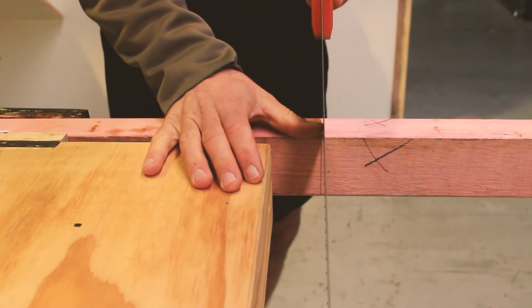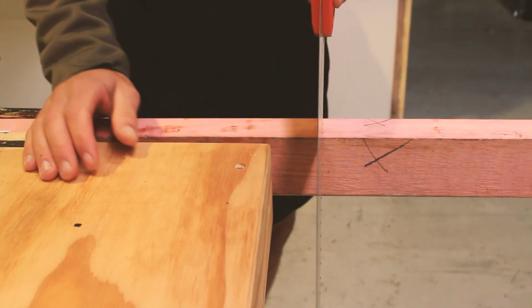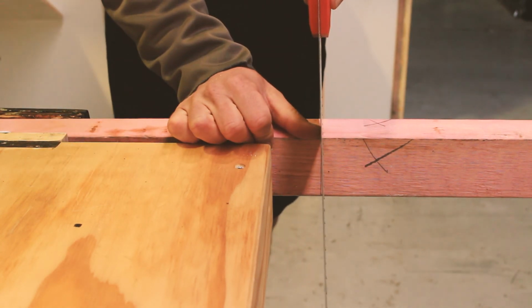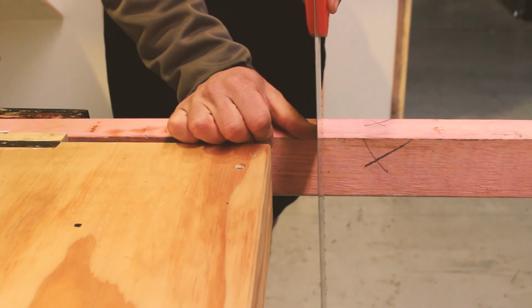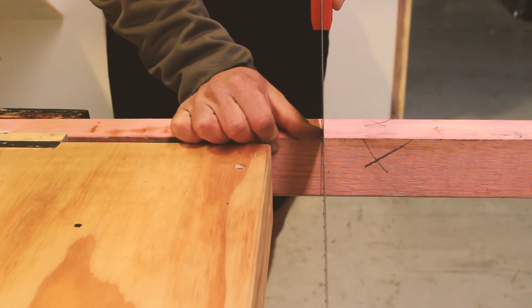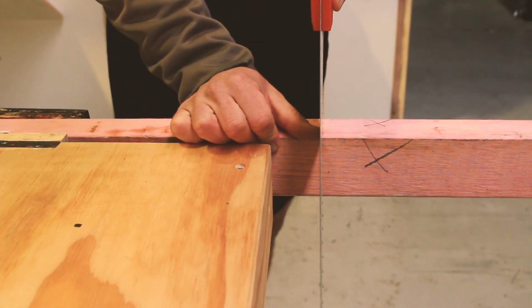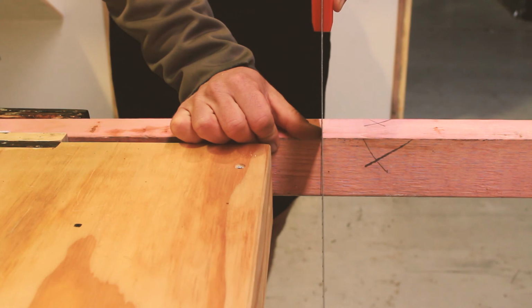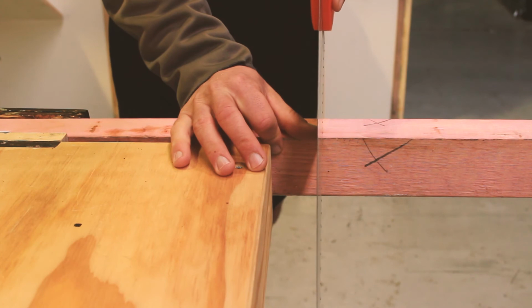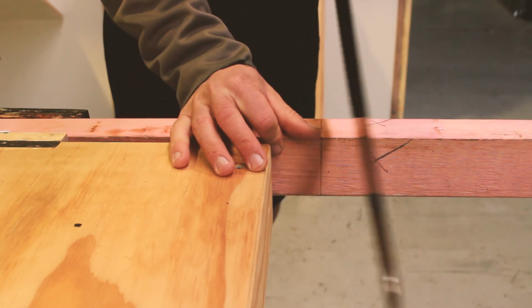Pop the saw in there, find that very specific point which is on the line, and have the blade near the top, near the handle, and I use my thumb to guide it. The initial incision is achieved through a draw stroke. A draw stroke being that you're pulling it towards you like a seated row, and you're pulling those weights. You're retracting your biceps. So as I pull here, I'm starting it.